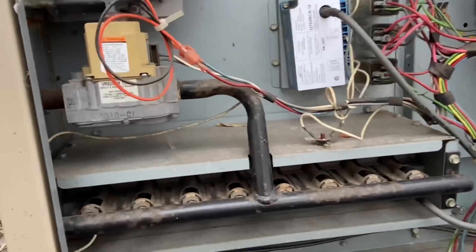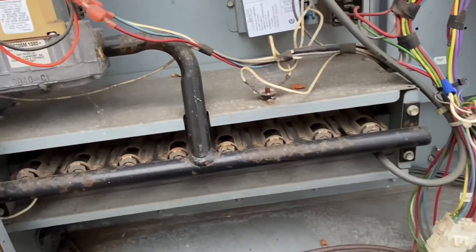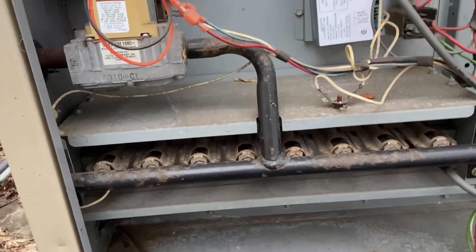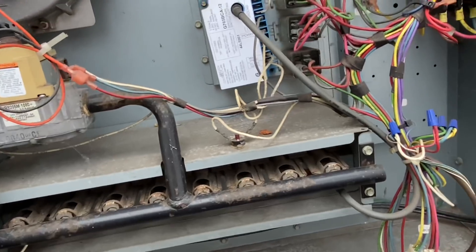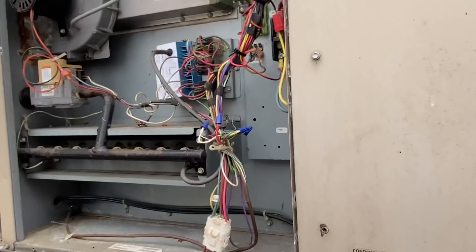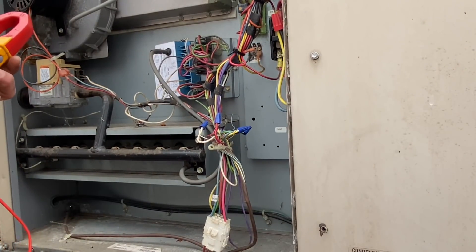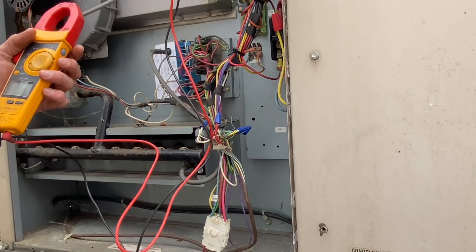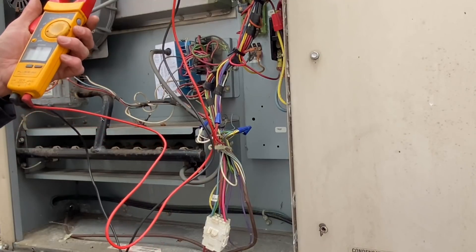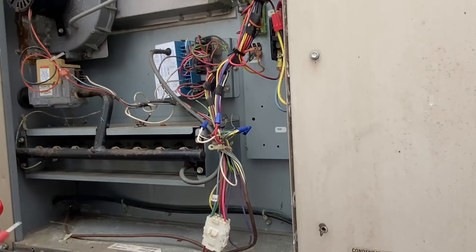All right, so it's right now retrying. That's the easy one — always the easy one to find out when there's a problem. Let's see if I put you guys right here so you're still seeing what I'm doing. If I check this pressure switch, what do I got? Zero. So my pressure switch is not at fault.